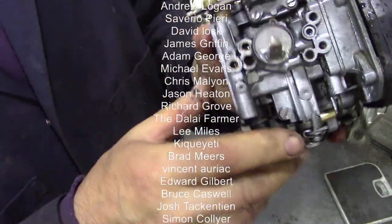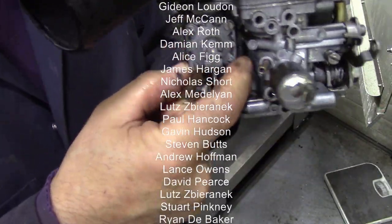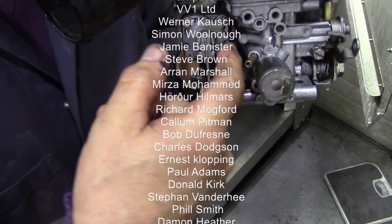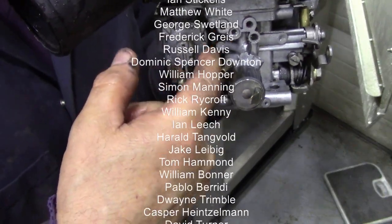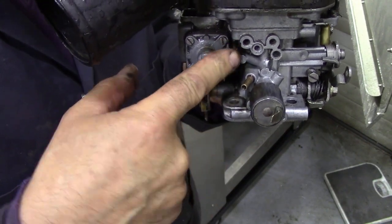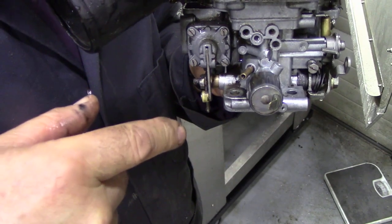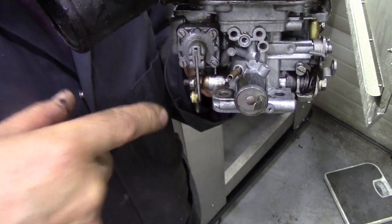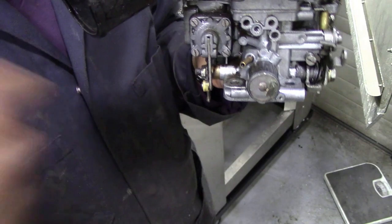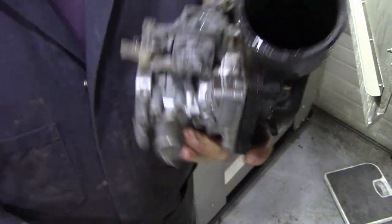It's lovely — there's no way you can get into there without sandblasting. The problem with sandblasting is when you go into cavities like this, the sand bounces back. There'll be like an air pocket and it's a very strange thing — trying to sandblast into the bottom of a cup doesn't always work, because the air pressure pushes it back. So I'm going to spend a bit more time on that and come back and have a look when it's finished.